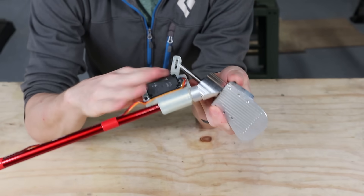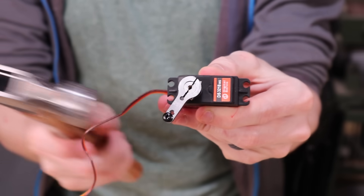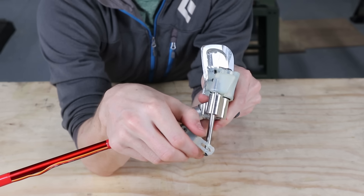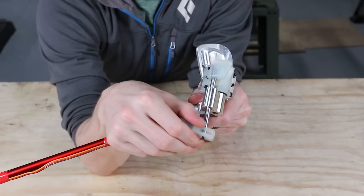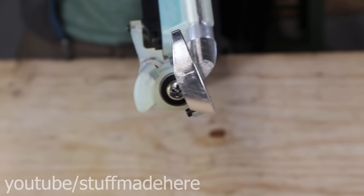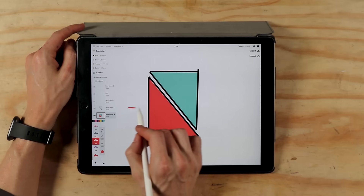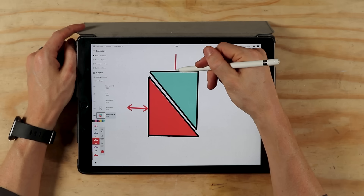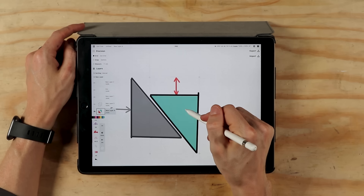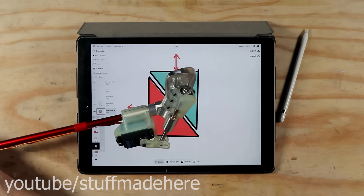Here's what I came up with. I'm using a servo — a really fast one — to actuate the face of the golf club. I know I said before that servo motors can't work, but this one works because I'm doing a very sneaky trick. I'm rotating the face of the golf club by moving this rotational cam here. The geometry is such that it does not matter how hard I hit the face of this golf club with a golf ball — zero force is going to be transferred to the servo. This red triangle represents the cam that's moved left and right by the servo. This blue represents the matching cam that's rotated when this moves in and out. So if this red cam slides out, the blue cam slides down, and vice versa.